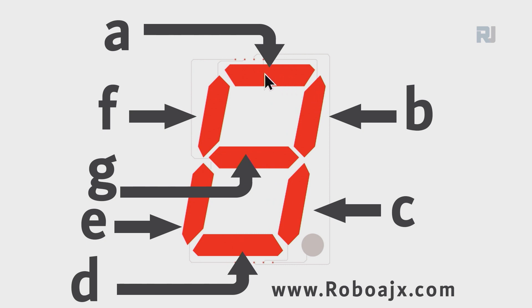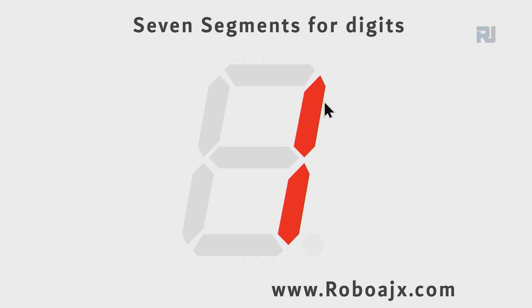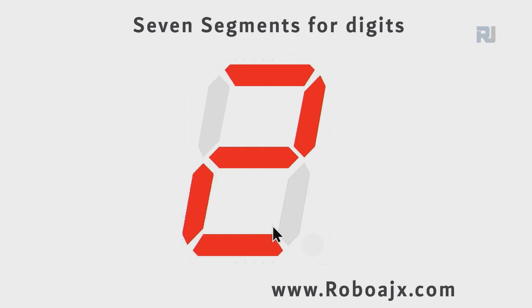To understand the seven segment display: it is seven pieces of LED arranged in a package where we can turn on each element to make a digit. It starts from segment A and goes clockwise: A, B, C, D, then E, F, and at the middle G. If we have a decimal point, that's DP. When we turn on all six segments except the middle one it's zero, then one, two, three, four, five, six, seven — like that — eight, and nine.